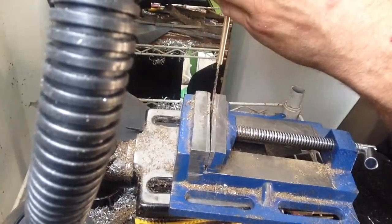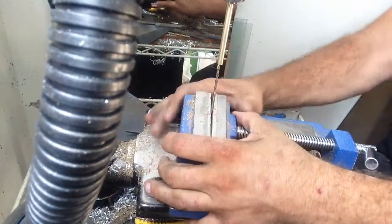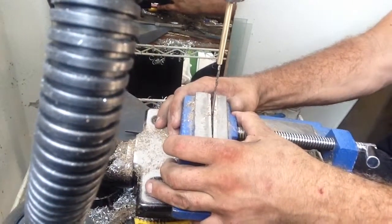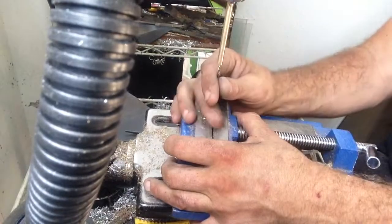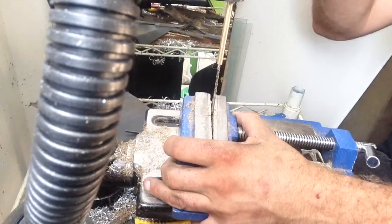Just envision that. I'll drop this in — you can see I'm not lined up — so I'm just going to move it into place. Because I've drilled down to the shoulder on the center drill bit, I'm not worried, because this will find live center.